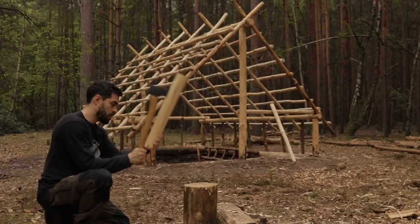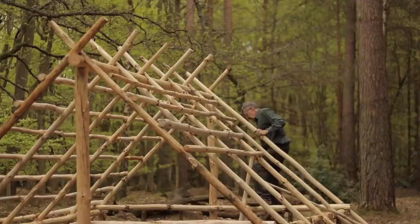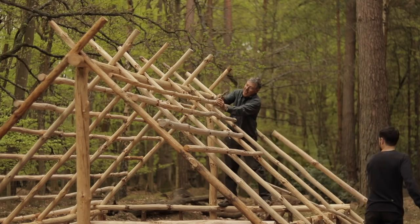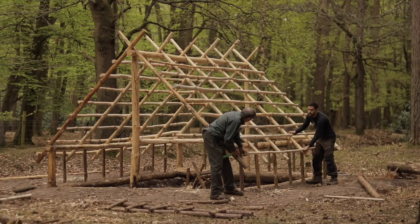And if we use some sort of thatching material, like thatch or straw or something like that, when it rains, it absorbs into that material and it becomes really heavy. So it looks like thatched roofs are lightweight, but actually there's a lot of weight on there when the moisture's in them. Whereas tiling, like cedar shingles or any form of shingles, the rain runs off. It doesn't collect on them, so there's not much dead weight on them. You've got to shed the water. So that way there's no water on the roof, there's no weight on the roof.